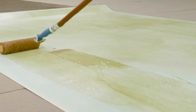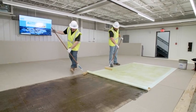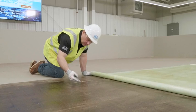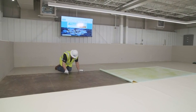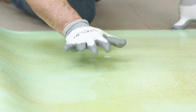To ensure the adhesive solvent flash-off time is uniform, apply the adhesive to both surfaces simultaneously in one application. Using the finger push method, check the adhesive by applying pressure with a finger to the adhesive while pushing across the adhesive. The adhesive is to be tacky, but not stick, string, or be liquid.